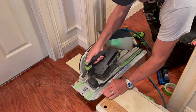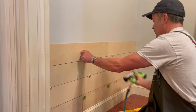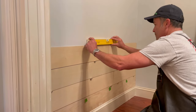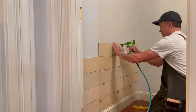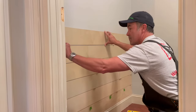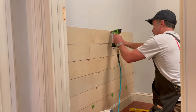That's the only fastener I'm using. You'll notice a spot where the pins weren't in the gun and a piece fell off — I actually did it on purpose, because we do a lot of changes to our house and shiplap is kind of a trendy thing. I think in four years or so we might want to take this down, and I'll love myself when I go to pull it off. If you were doing it for a customer or knew it would be up for a while, I'd recommend construction adhesive from the caulk section — it goes on like caulk but holds great. I just wouldn't want to have to remove that because it will destroy the drywall.